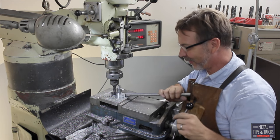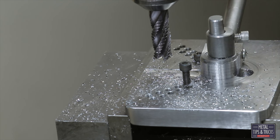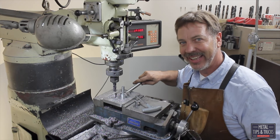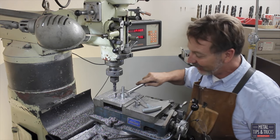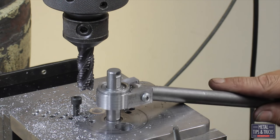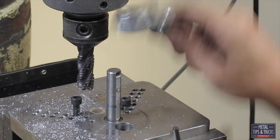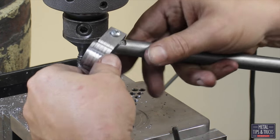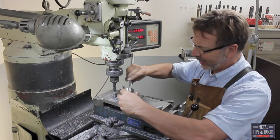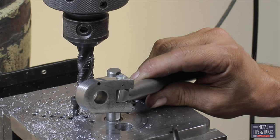Now is that slick or what — fast, easy, and it has got a good radius on it. I know there are going to be some people saying that is not an accurate way of doing it, but it is about quickness and efficiency. The inaccuracy comes with how this fits on the pin, and you have different size pins for different size holes. I have got a coarse little shoulder on here and I plan to take this to the surface grinder and clean that up by hand. The handle is pretty much set up — next we need to drill a hole through here so we get a pin in to hold on to the shaft.